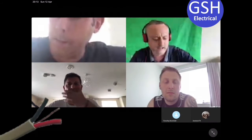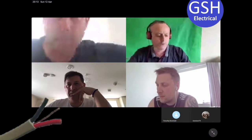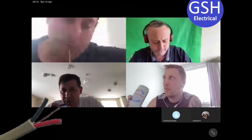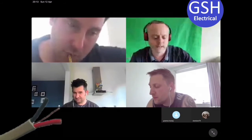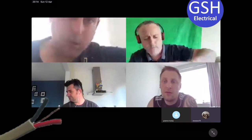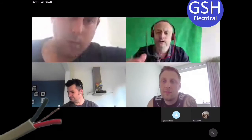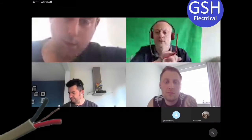Back in 2004, we changed our cable colours for single phase. So let's go to Tim. Can you remember what the old line conductor colour was? Red, wasn't it? Or black? Yeah, I'll go first one, red. Red. So line was red. And Nick, can you remember what the neutral colour was? Black. Yeah, it was. So as we look here, we've got a cable that predates 2004, and of course, we've got the red line conductor and the black neutral.